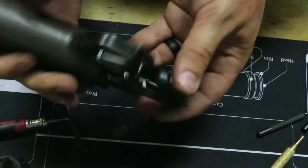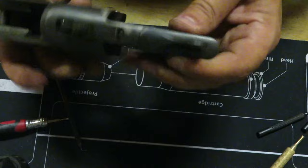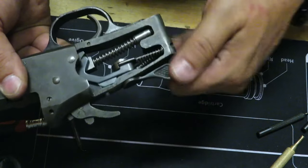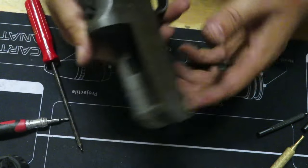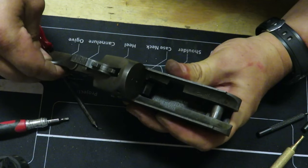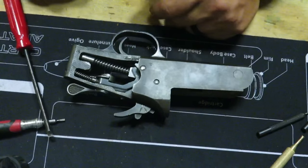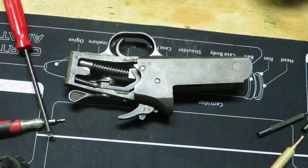That's kind of a bear with these older models — getting these springs in there without some type of actual compression tool is tough. But you can see now I can go either direction and it works. You want to move that coupler — doesn't matter which way you go, lefty or righty. Look down inside and you can see it actuating — see how it's moving down? That's what you want — make sure it's moving all the way out of the way. That is putting the receiver back together on a Savage 24E.